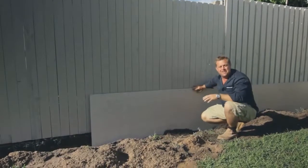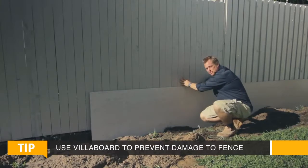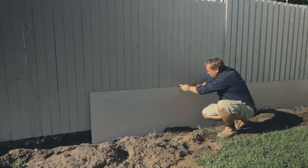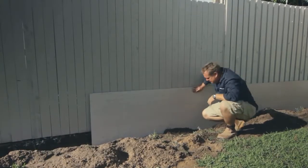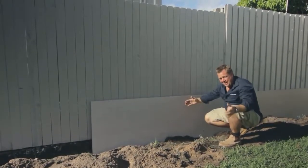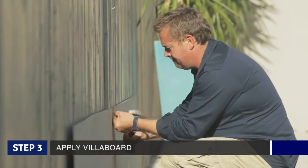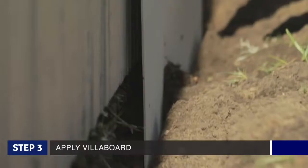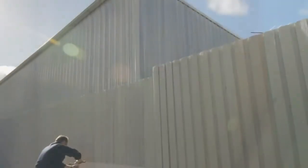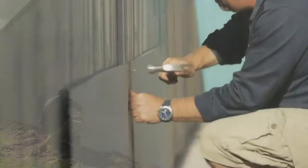Villaboard is a great, cheap and easy way to keep the garden bed off the fence. You don't want the soil in contact with the palings — it'll end up rotting, and it'll wash through all the gaps into your neighbour's, and you'll lose a friend. But by putting this up, you can retain the garden bed. You can't do this if you had a sloping block and you're retaining everything, but we're just retaining a garden bed like this. The pressure and the weight is going down, not to the sides, so this isn't going to knock over your fence. I'll just tack it off with a couple of nails, work my way along, and when we backfill, you won't even see it.